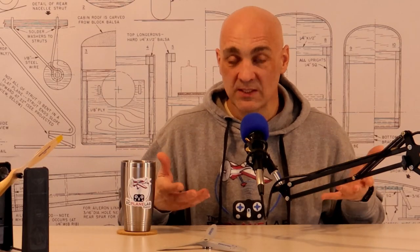There's a good chance that it's not going to be balanced because the propellants and the things they use in these paints boil off as the paint cures. And then you don't have as much weight as when you started. Do they boil off or just evaporate? Well, evaporate. I think whatever the term is. But the propellants and the VOCs in that paint will evaporate and take weight away from the blade. So it's important to let that stuff fully cure. And when I say fully cure, I mean so that it's not tacky or sticky anymore. And you want to do several light coats.